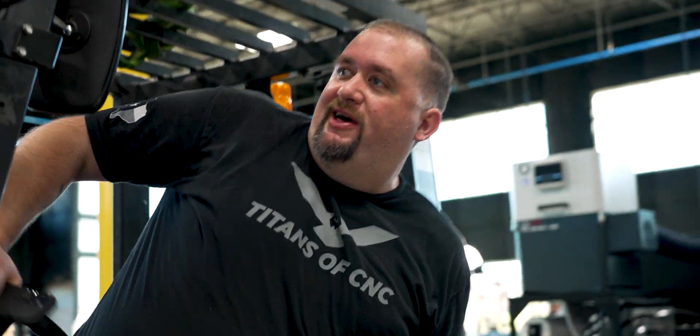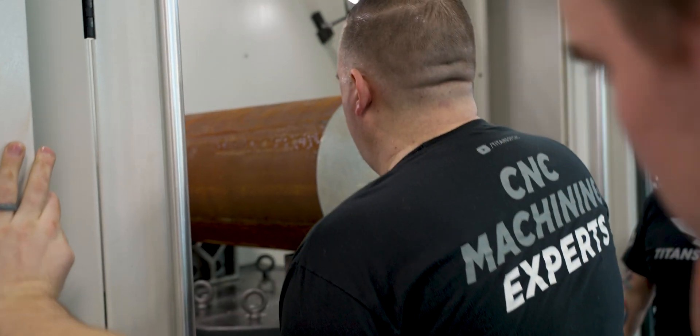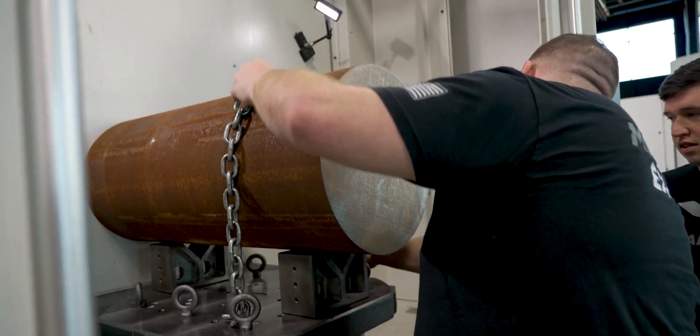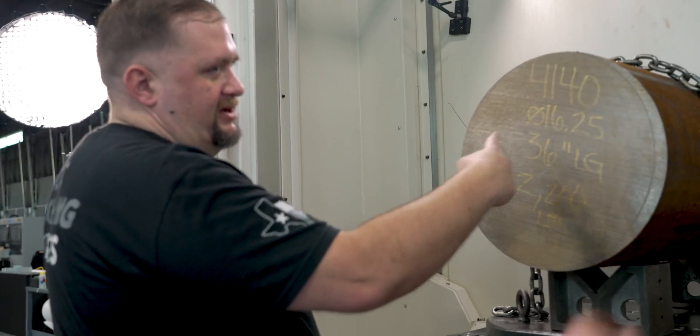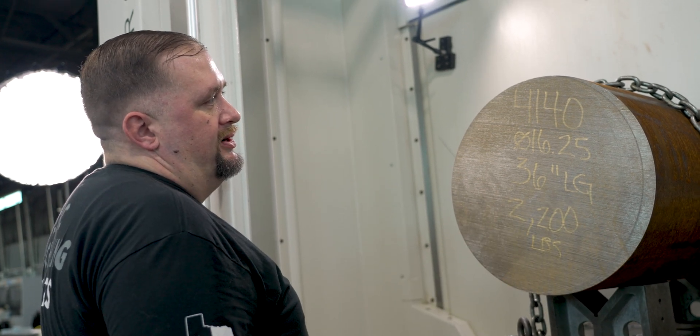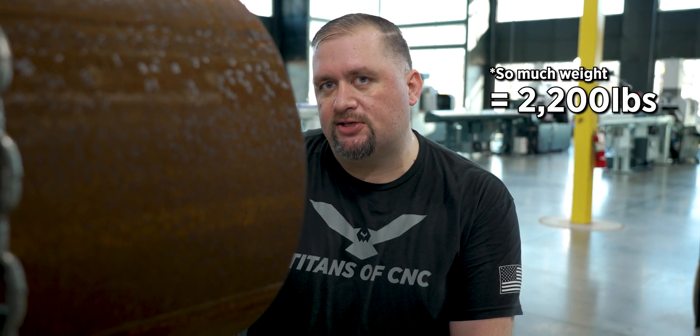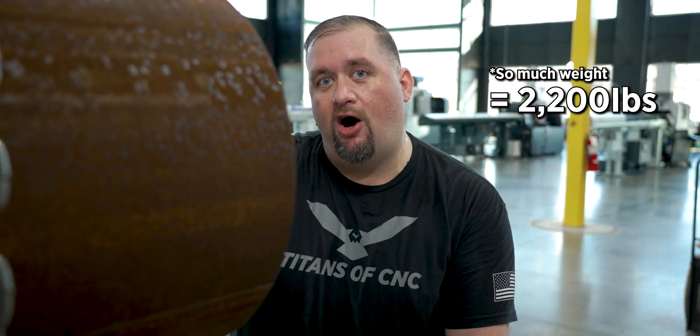The plan is to put straps around this, pull the straps down, and kind of rely on the weight of this thing to not move when you try to machine it. I'll have a bolt going across here, do the same thing over here. All I have to do is take about 50 thou off that face doing 20 thou dynamic passes, then put the four pull stud holes in and thread them — so I'm babying the drill. We just got our beast mode piece of material loaded on the v-blocks. I'm going to use one chain for a rigid grip and a bunch of ratchet straps. Super sketchy. I have to change pallets manually because of all this weight sitting about six inches off the table — I don't want this sucker rolling off and destroying all my sheet metal and way covers.